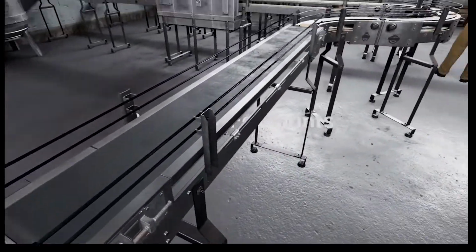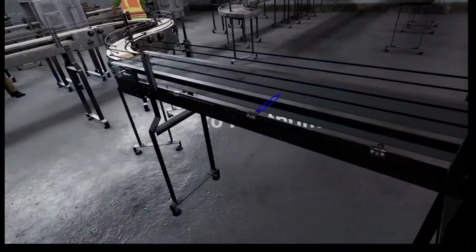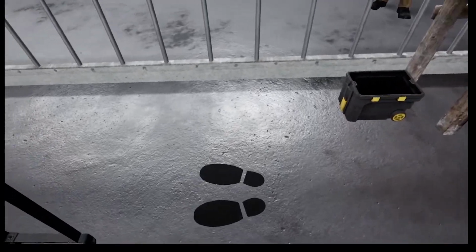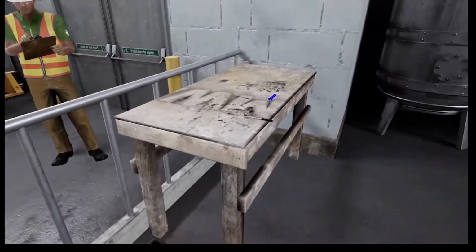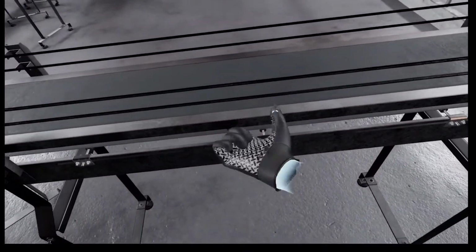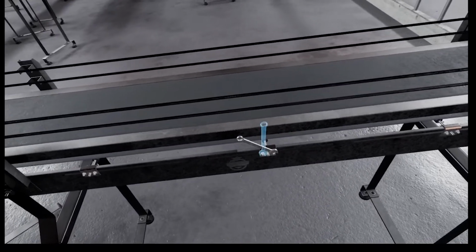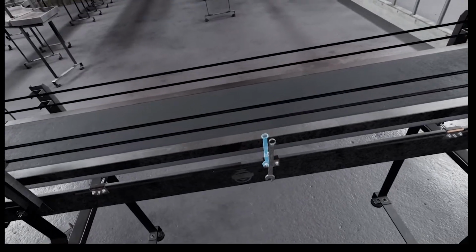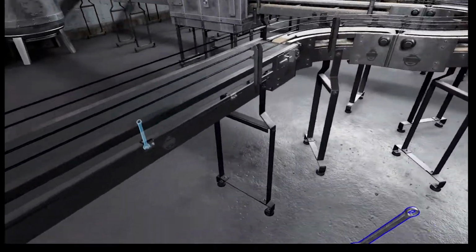That's solid work, but it didn't fix the problem. You need to troubleshoot around the carrying rollers. Great, you found the trouble roller. Let's loosen its nuts on both sides. Okay, untighten the other side now.